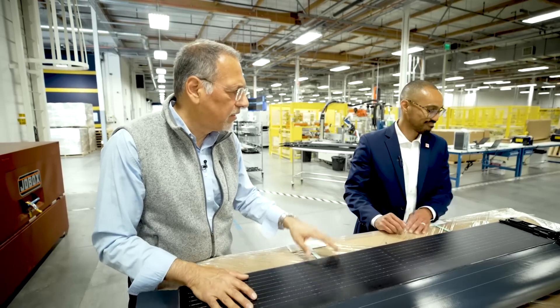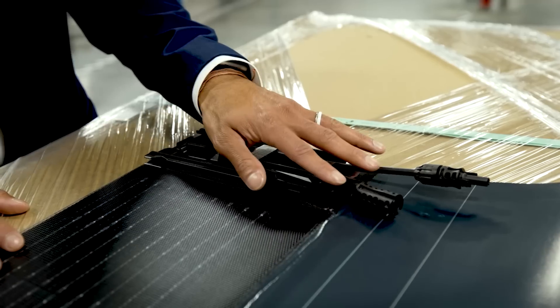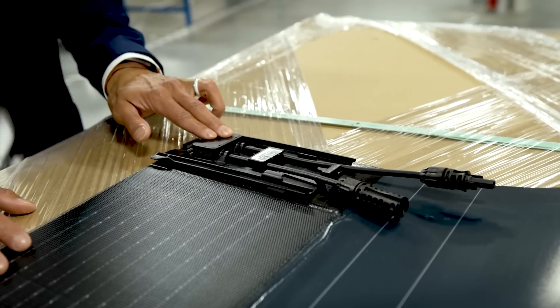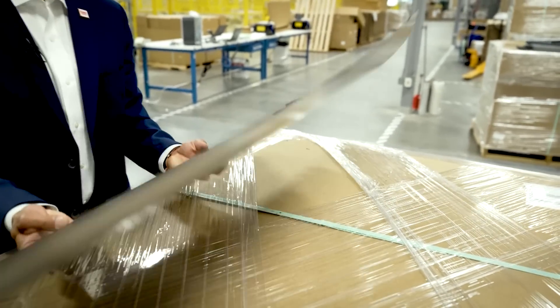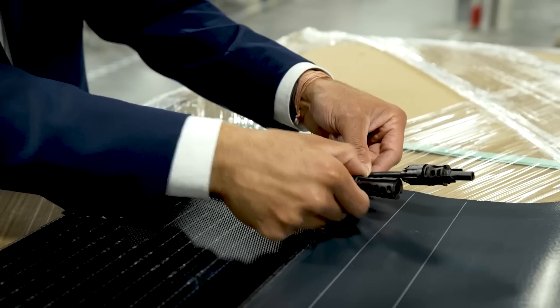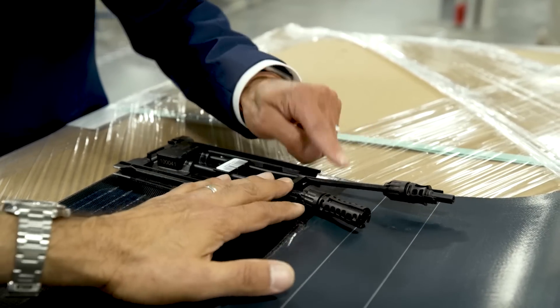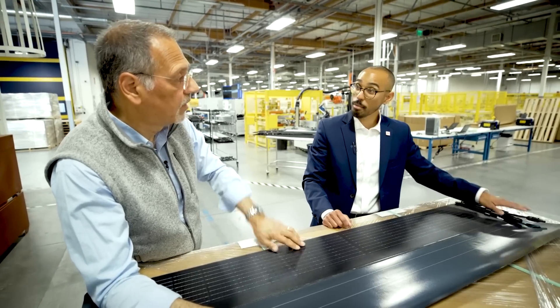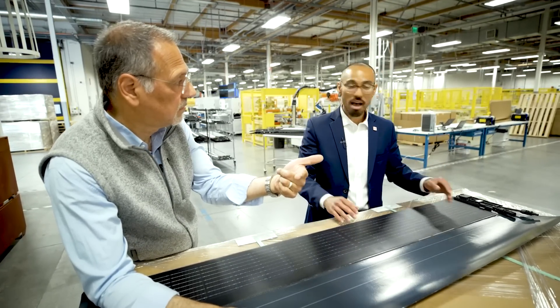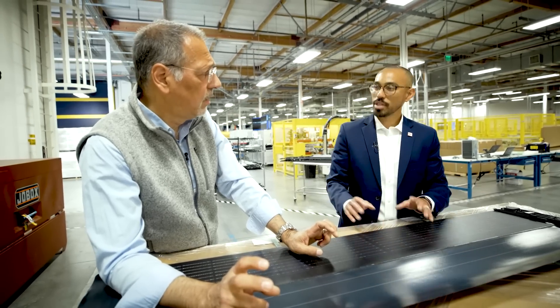For the solar geeks out there, they're going to want to know about the wiring and inverter technology. That's just a connection stack over there — all of our connections go straight up the roof, stacking all the way up, and then daisy-chaining together, which provides very easy pinpointing if you ever need to get to these wires from a serviceability and maintenance standpoint. They're not under something. And then all of these connect at the top and land into a central inverter on the side of the home — that's what they call a string inverter, as opposed to using micro-inverters at each panel.